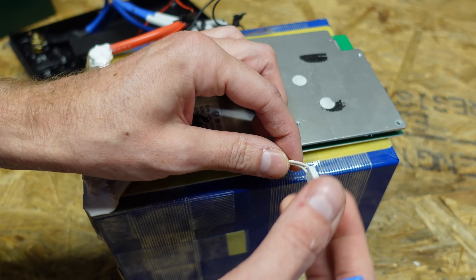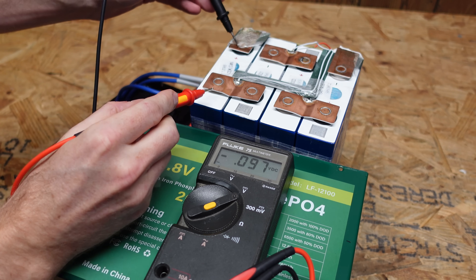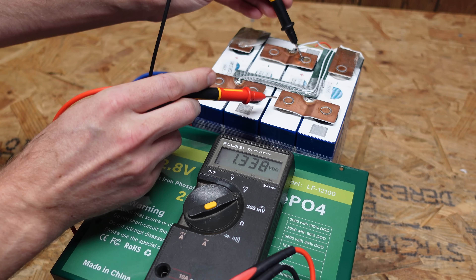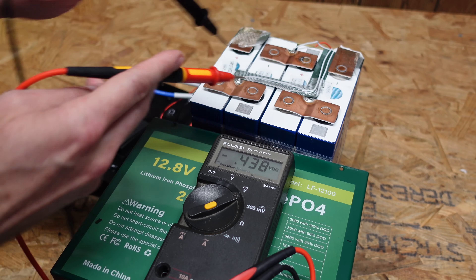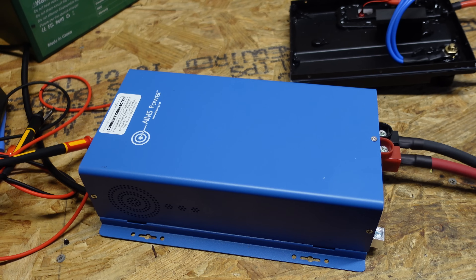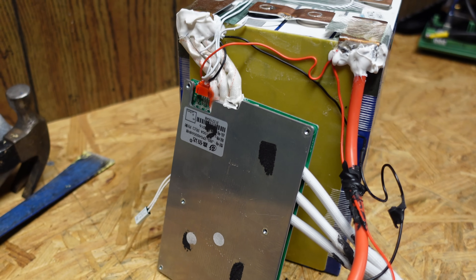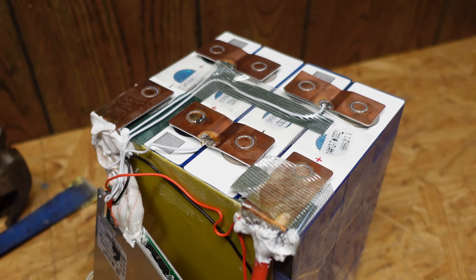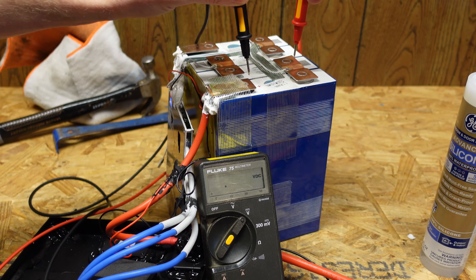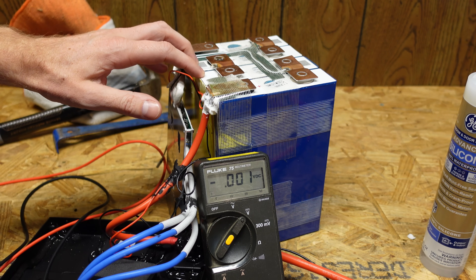I'm chilling a glass of water in the freezer to test cold temp protection shortly. Checking cell voltages at empty state of charge: we've got 2.95, 2.89, 2.75, and 2.89 volts. It's this one cell sitting at 2.75 volts — the lowest of all four. The cells may be slightly out of balance, though the discrepancy isn't huge. After putting my charger on the battery and watching it stop, I see a blue light blinking on the BMS. Checking cell voltages: 3.33, 3.34, 3.34, and 3.60. That last cell on the end has hit high voltage disconnect before the other three have even finished charging.